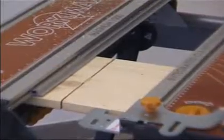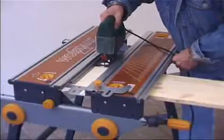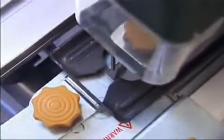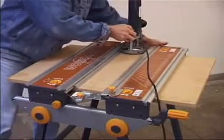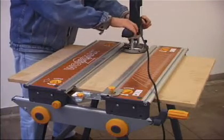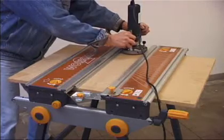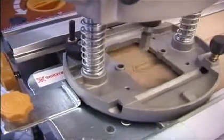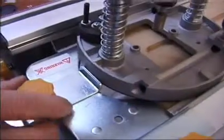The power tool is run across the workpiece providing a perfectly machined cross cut. The Zoom Magnum may machine workpieces of up to 600mm in width. The beauty of the Zoom system is that it is simple and direct — quicker to use, more precise, and much more cost effective. You do not have to provide a tool plate, align your power tool to it, and then provide parallel bars to guide the tool plate. You just adjust the jaws of your clamping table and slide your power tool between them. As simple as that.